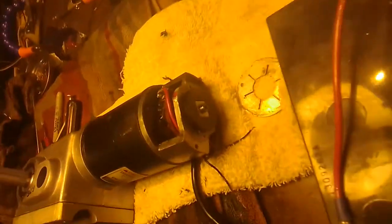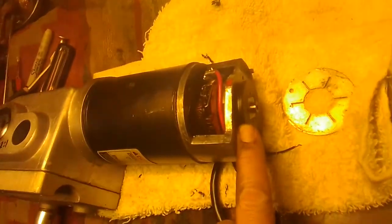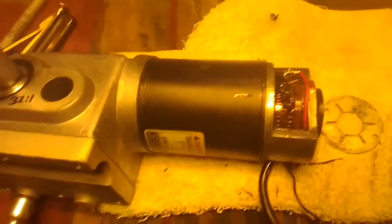We now have our parts here that go on to the shaft, and that's going to give us our model for doing some 3D printing of an encoder to put on the back of the wheelchair motor. Once we know how fast this is spinning with an encoder — probably a hall effect, but maybe an optical — and we know we've got a 32 to 1 gear ratio, we should be able to figure out exactly how fast our wheels are turning based on our motor speed. Making progress.